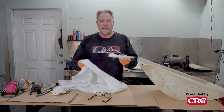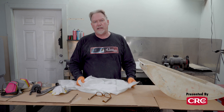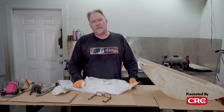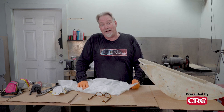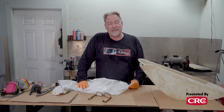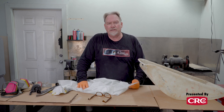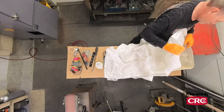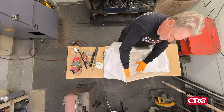Cloth is stronger than mat. We're going to use a combination of both, but I want to get at least one layer of cloth in and dry because that will give the seat a lot of strength. A race seat — even though this is a passenger seat used for parade laps — you'll want it to be strong. Fiberglass seats are not legal in modern racing anymore, but in vintage racing they still are, and we're trying to keep this thing very authentic. You're basically trying to do this in as few pieces as possible.